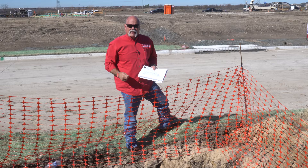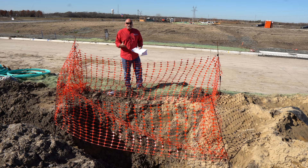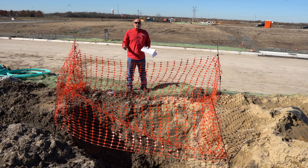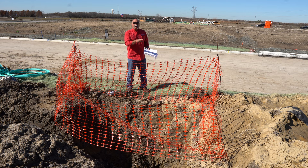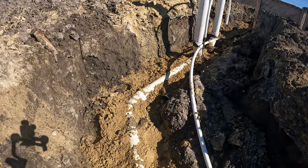The plumber ties into the city tap, comes up out of it, runs everything over to the house with a full-size four-inch line all the way to the clean-outs. One thing I like: where there's a city tap, I like to come out and come up as straight as I can and give myself a clean-out right there. That way if there's ever a problem, a plumber can run a camera down to check if the tap is in good condition or if roots have penetrated it. Then I put a combination or a Y to come over and catch the main drain.